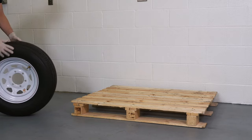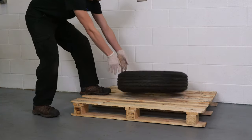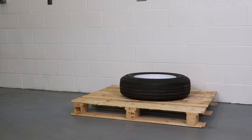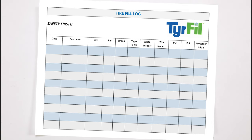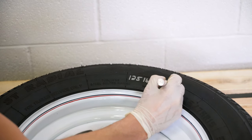The filled tire must now be laid flat to cure. Tires can be placed on pallets to make handling easier and help maintain the temperature, especially during winter. Write the weight and the PSI on the tire and record the data in your flat proofing logbook. This logbook is used to record processing data for the customer wanting more information.